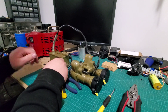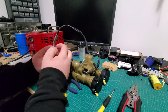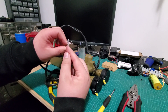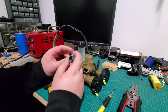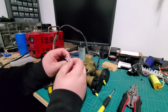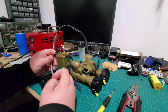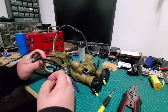Once you get this cut, you end up with seven unlabeled white wires instead of what I was expecting — just a positive and a negative. So the only way to know the polarity of these is to open this transformer up, hook a power source up to it, and work backwards with a voltmeter.